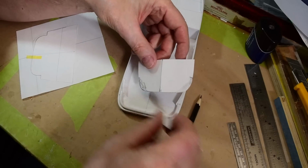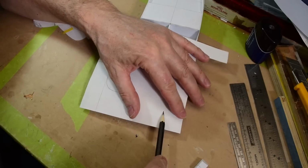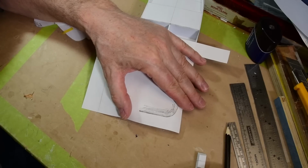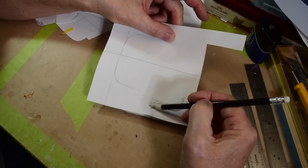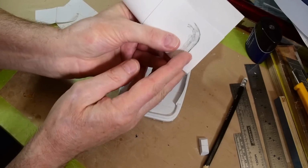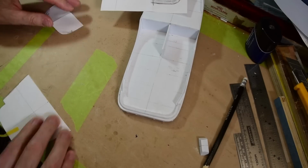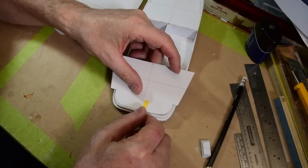But one of the tips I can give you is to do a paper rub, like halfway. I think I showed this. If you want to pick a line out like that, see how it leaves a line, and then make sure you mark a center line, and you just need half, and then you cut that out. You just fold it in half, and then cut it out, and then unfold it, and you'll get the inside diameter of this pipe, which will get you started. And now I've gotten to this. I've had to do this 3 or 4 times, so I'd like to get it right.